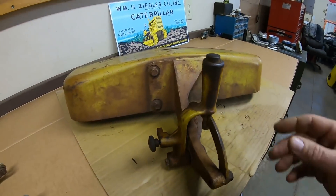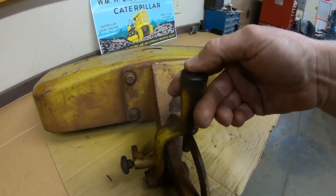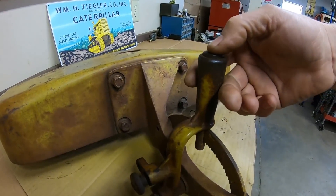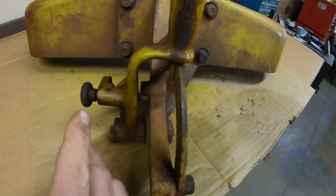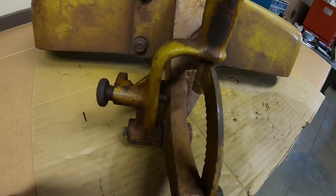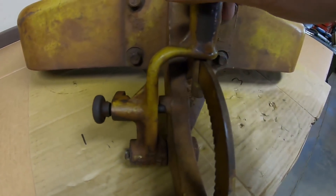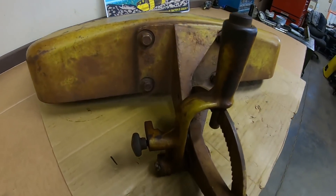We've got some issues with the throttle lever for the diesel engine on the top cowl. It's pretty loose because the button on top is supposed to have decent spring tension to engage with the notched quadrant below — it's pretty mushy, so I'm betting that spring is broken. The detent plunger for the shutoff has way too much free float; it should be under spring tension at all times. As far out as I can pull it, it's not going to drop into the hole for the end of that peg, so you won't be able to get it to full shutoff. We're going to have to remedy both of those issues.